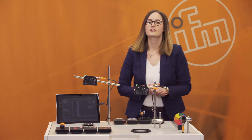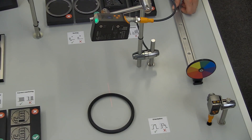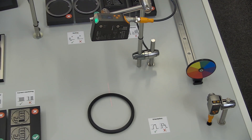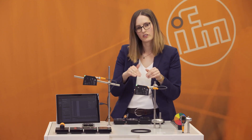The next advantage is distance independence. Within the working range of the profiler — which is 150 up to 300 millimeters — the profiler works distance-independently, checking for the profile within this working range. This makes it easy to adjust the profiler; you don't need to find the exact right spot or position, as the profiler always looks for the right profile.